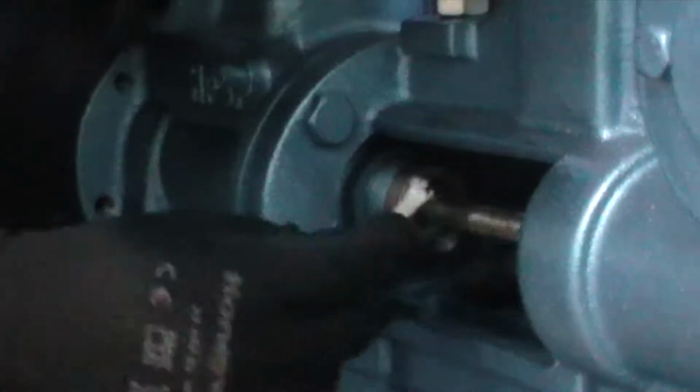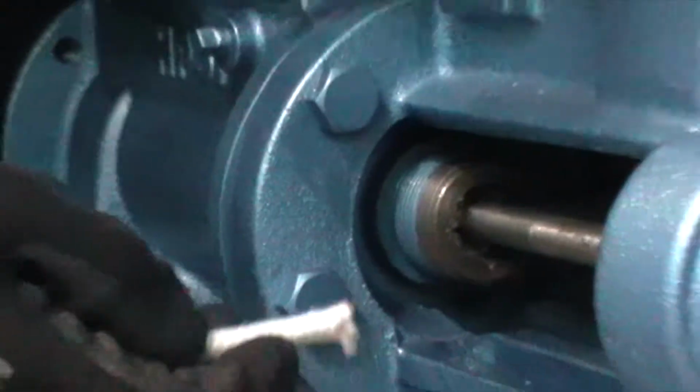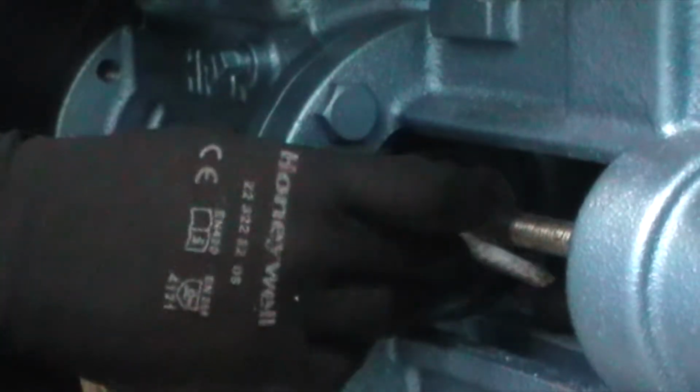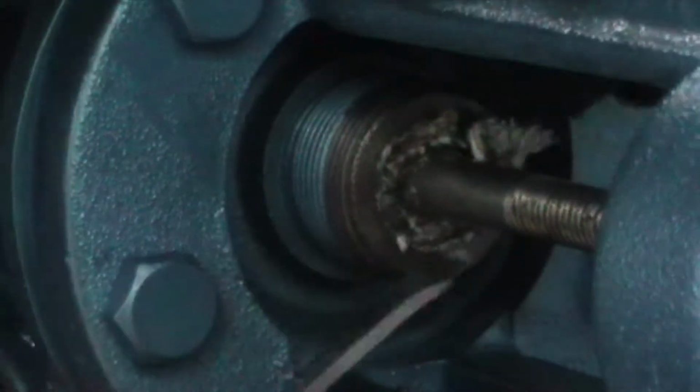This goes down again. Now, what really helps is when I put these gland packings in, I want to stagger where the ends are. So if the first piece goes there, I want to make sure that I have the next one following another place around there so that we don't get all of the end pieces in alignment. We want them staggered around so that you don't get water bypassing through the gap. And again, just slowly working, pressing that all the way in.